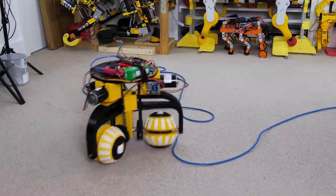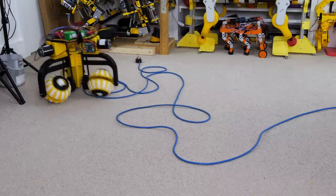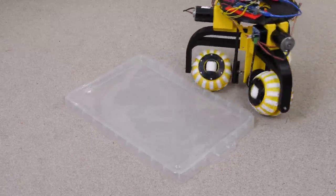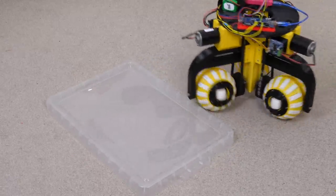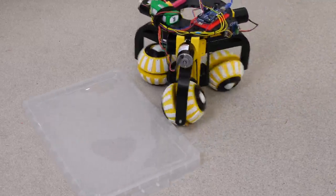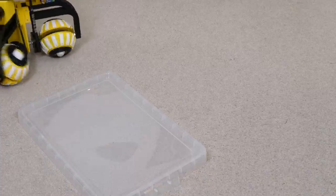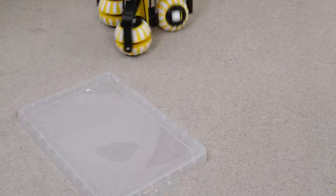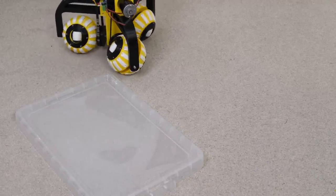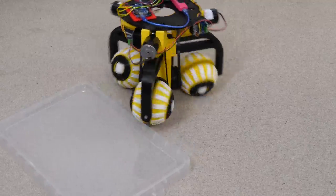This reminds me a lot of the ball wheels on the directional robot which dealt fine with low obstacles like a bit of coiled up mains lead on the ground, and initially it looked like it was going to be quite good at multi-terrain. However anything with a bit of an edge caused real problems because as soon as those wheels came off the ground the passive wheel behind the third wheel doesn't have any drive in that direction so it can't help push it along and push it up. I did have some TPU grips on these wheels but that didn't really seem to help, probably again because the wheels are at an angle so we never get those grippy parts straight on with the edge. So again an utterly terrible failure for multi-terrain — we need another solution which I'll investigate in the future.